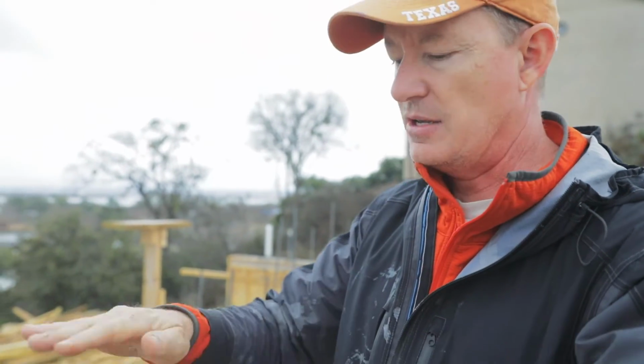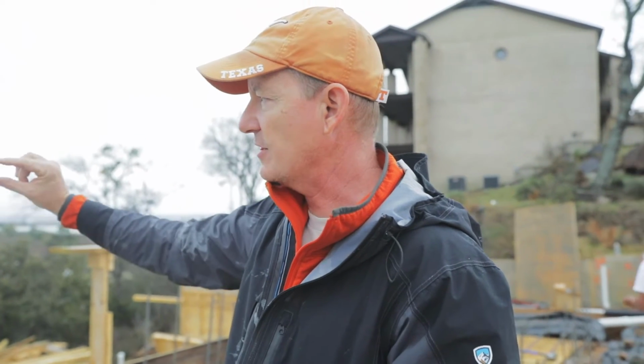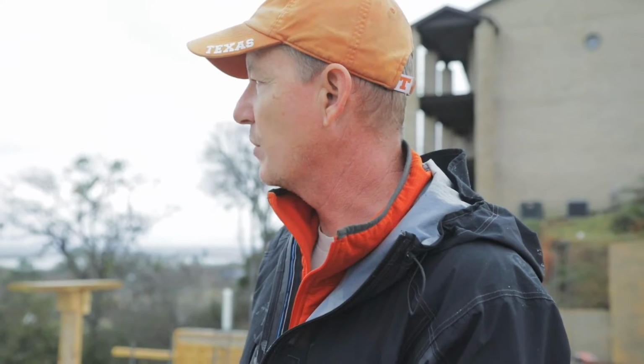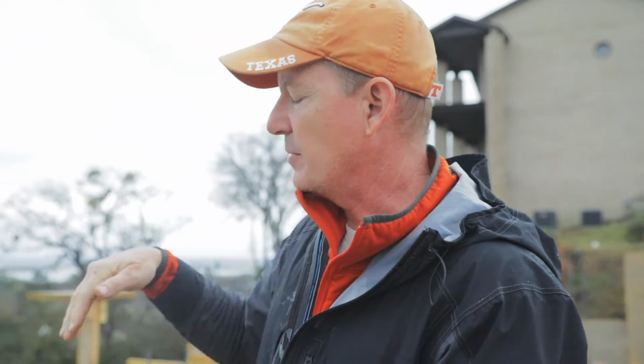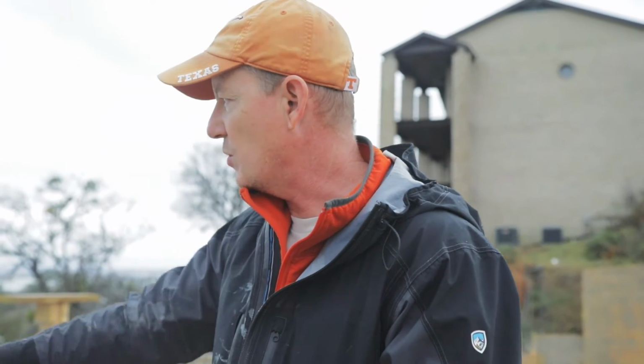So when you walk outside, you have a step down. We're adding tile on the porch and all that. Including the height of the tile, the Hardie backer board and the grout that we put out there, we'll still have about an inch and a half of a drop when you come out of the door onto the porch, so that any water from rain sheds away from the house.